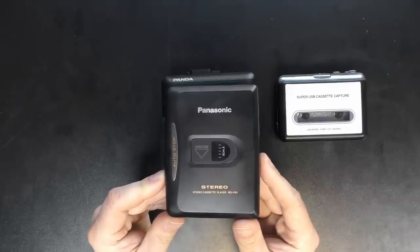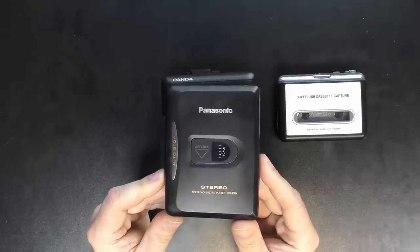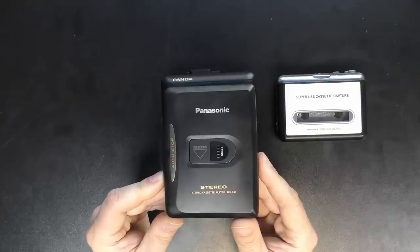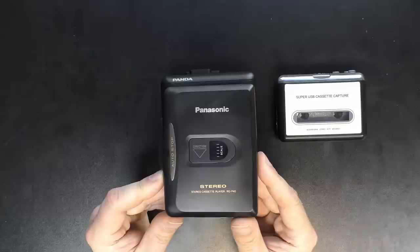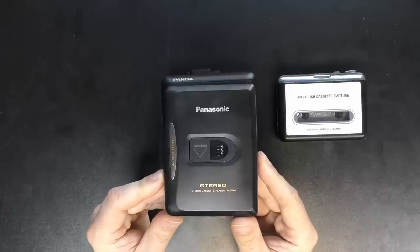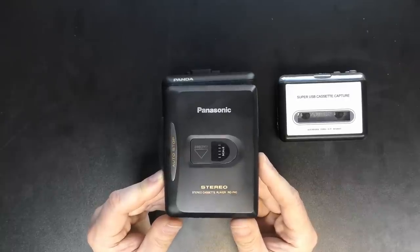They look at the wow and flutter, they look at the signal to noise ratio, they look at the signal itself, what it can go up to, and whether it's direct drive, what the heads are, and say, yeah, bang, this deck's better than that. But that takes out of the equation all of the circuitry behind it. Like with my Arcam Delta 100 cassette deck. Yes, the mech comes out of a Denon DRM-800A, but that's all. The rest of the circuitry, all the multitude of Dolby boards and everything in it, is all Arcam, and that makes a difference to the sound. So like I say, this sounds good.